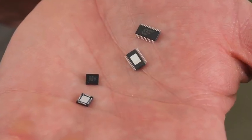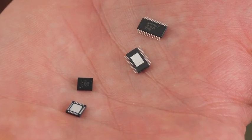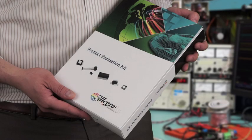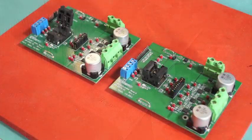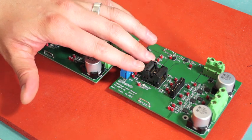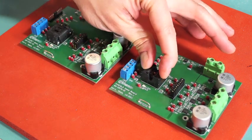One advantage of the A4915 is its package size. Two package options are available — the actual size of the leadless device is five millimeters by five millimeters. Here we have the two evaluation kits available for the A4915: the first is for the leadless QFN, and we have a leaded board with an ETSSOP device.